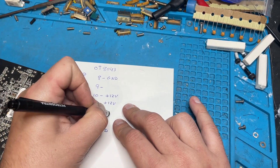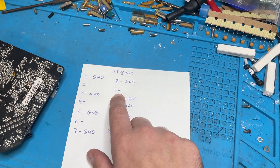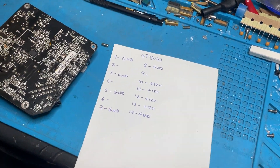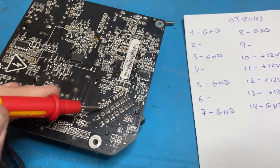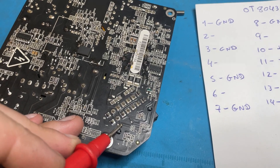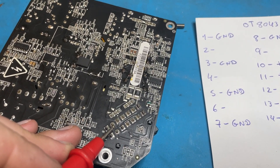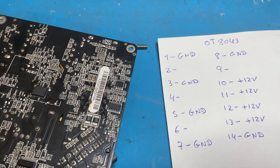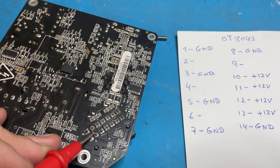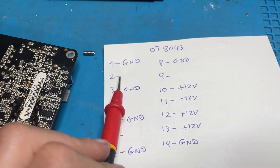What we don't know yet: pin 9, pin 2, pin 4, and pin 6. I see that this pin and this pin have a path through here — I think maybe it's the brightness section of the screen. Let's assume that pins 2 and 9 are the brightness control for the DC inverter that powers the backlight.